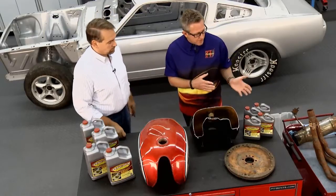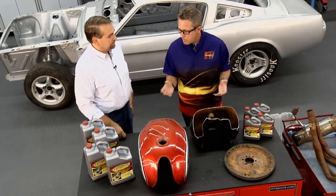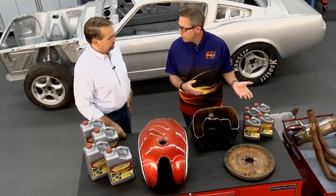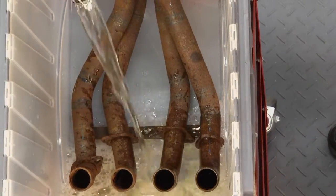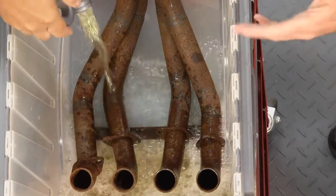Let's show people — we've got some products here that have some rust on them. Let's show them how easy it is to use Evapo-Rust. All we have to do is pour it in and let it work. Just dump it into a tub — any kind of tub, bucket, whatever you want. Is there any prep work we have to do? For removing rust, no. If it has heavy grease, you probably want to get that off first, because Evapo-Rust is biodegradable and if you get oils and greases in there, now you've got to treat it for those.